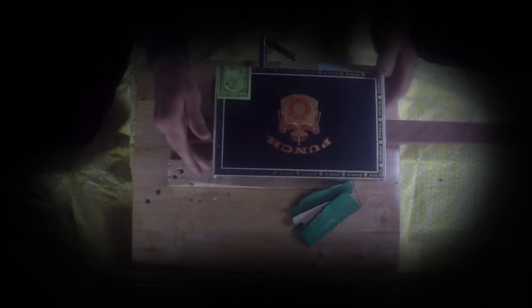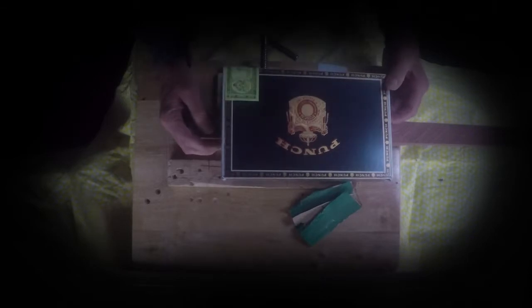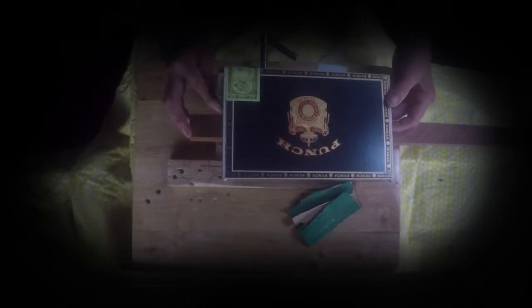There we go. That's 2/16 as well. And final check for the box. Before I cut the outer lines, I'll cut on the inside of the line, so if I need to readjust I can chisel it or just sandpaper half a millimetre off.